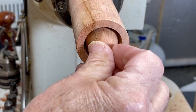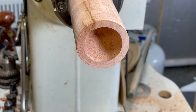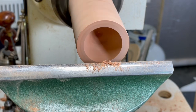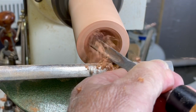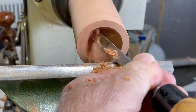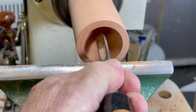You might want to go a little deeper. The rim doesn't have to be that thin — it's not like a goblet. Matter of fact it's probably better, and I'm not giving it away yet, but probably better to have a little thicker rim. So this is a great beginner's project because you don't have to get super thin. I'm going to go ahead down a little more. It would really be nice to kind of match that interior curve with the radius of the ball.